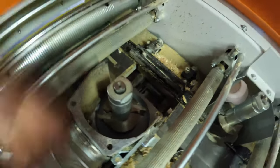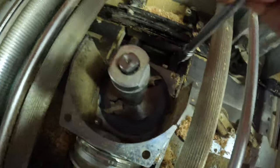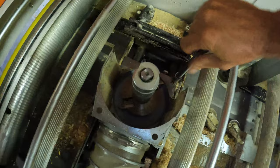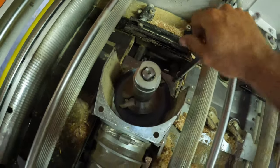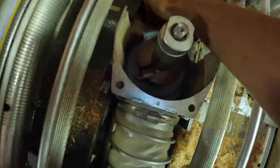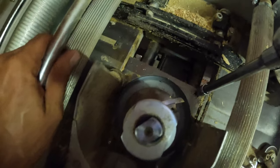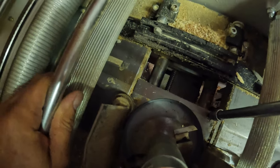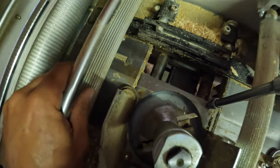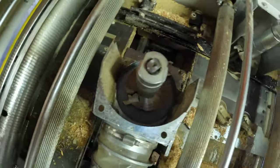This cutter head should now be set for width to this fence. On the MP360, you have two ways to lock this in — it's very important you lock the spindle because it will creep while the machine is running. There's an allen bolt here and also a handle underneath that you tighten to clamp it. Make sure you lock that off so it doesn't creep.